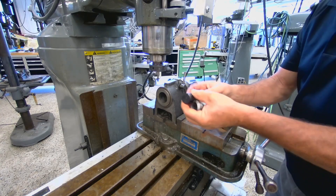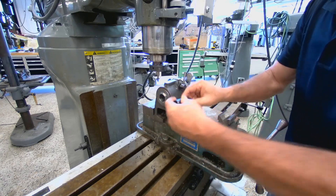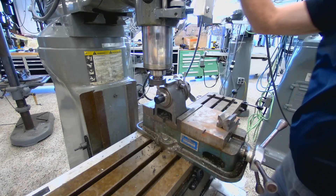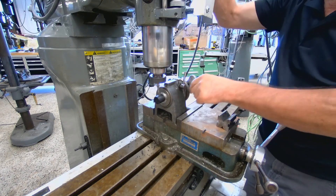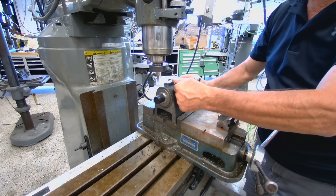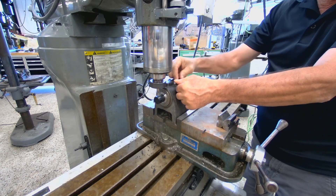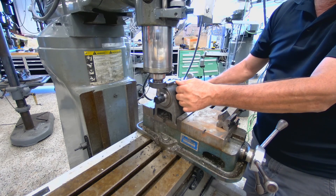In this setup, we're going to hold a round part and show you how to use the dividing head to drill holes 90 degrees apart. Tightening it up draws the collet in and locks it in place. There are notches on the top, and I'm going every 90 degrees, stopping and locking into that position to get four holes at 90 degrees. If need be, you can bring your tool into the work, unlock the positioner, and mill a groove on the surface.